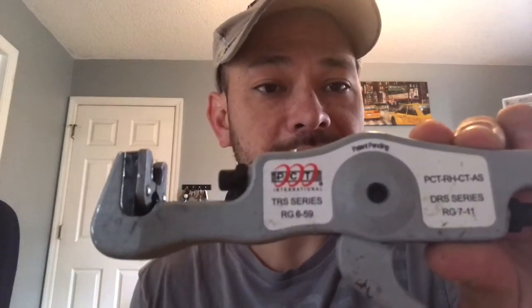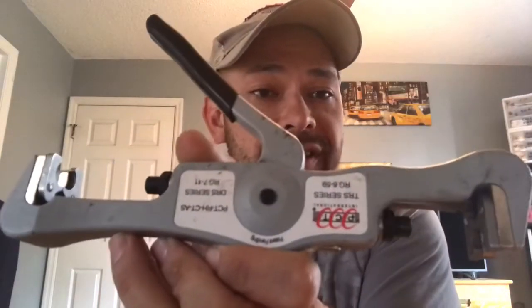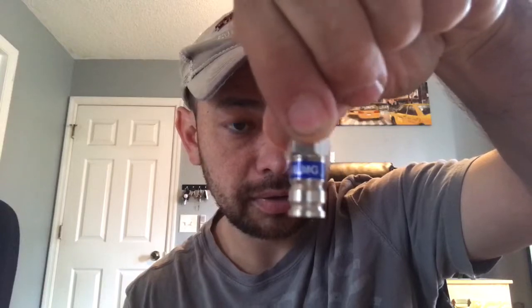Hello, my name is Vic Lam and I'm going to show you how to cut, strip, and make RG6 cables like a pro. The first thing is the tools: we have our Klein cable strippers for RG6, my DeWalt cable snips and cutters, and my cable crimping tool by PCT. This crimps RG6 and RG11 fittings, and I also have my RG6 fittings and my RG6 cable wire.